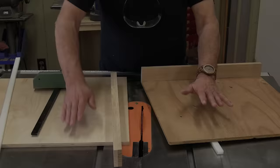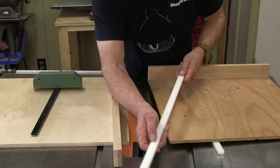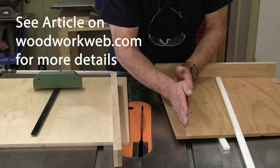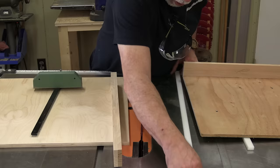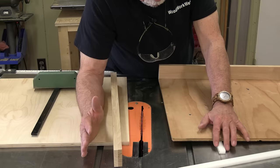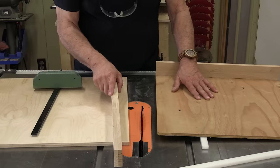Here's the prototype — I used construction-grade plywood but I did use plastic runners. I use plastic runners a lot on my table saw; I just go to my local plastic store and buy white plastic and cut my own. It's a little bit flexible, and that's actually good because when you install them they fit in fine with no slop. I never recommend using wood runners — wood expands and contracts, and sometimes it won't fit in the slot or it gets sloppy. Do yourself a favor and use plastic runners.